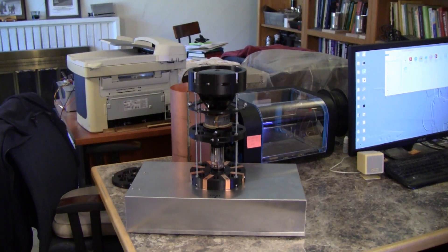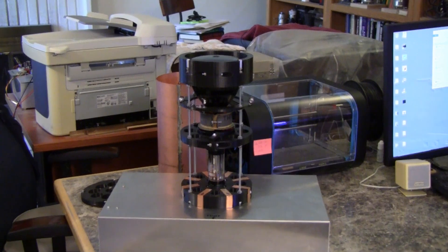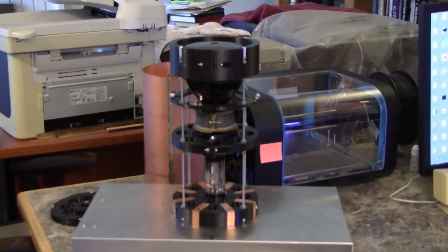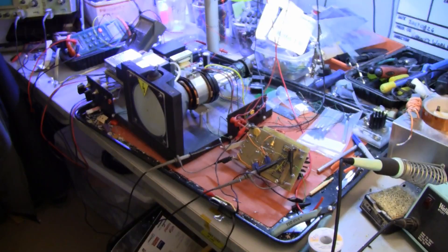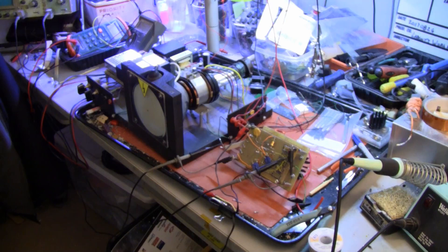So this is essentially the mechanical detail of the Chief. I've been working on this project for about three months now. The deflection electronics are giving me a hard time, as usual. Vertical is not so bad; however, the vertical circuit did suffer a component failure — one of the transistors burned out, possibly a bad part. The horizontal circuit, being of a somewhat resonant or tuned nature, is giving me cramps. I've battled this my whole life.